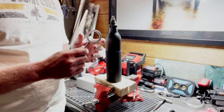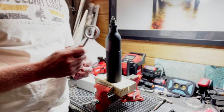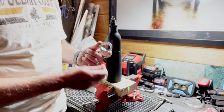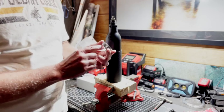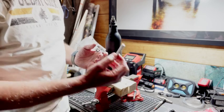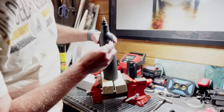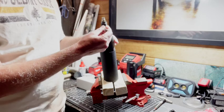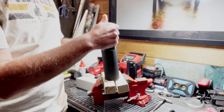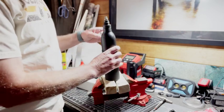This is a very inexpensive steel shaft collar that I ordered on Amazon. When it arrived, it had a grub screw — a 5/16-inch grub screw — which I've replaced with a 5/16-inch bolt that will also accommodate the recessed hole within the valve to make it easy to turn like that.